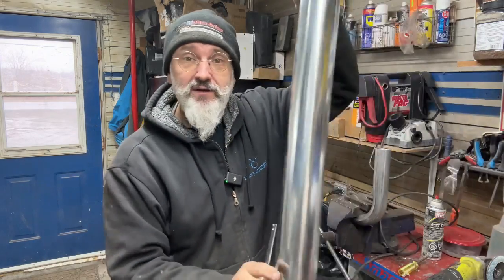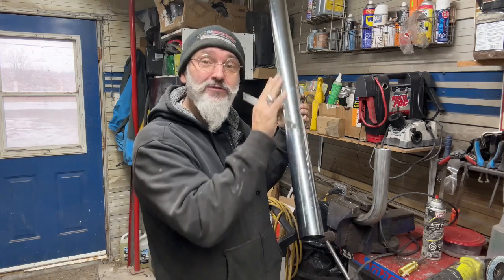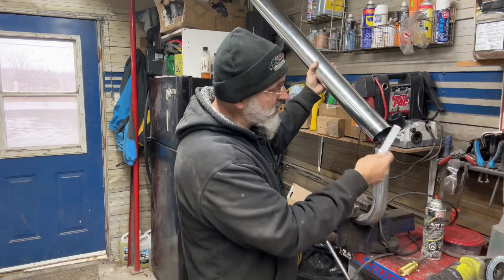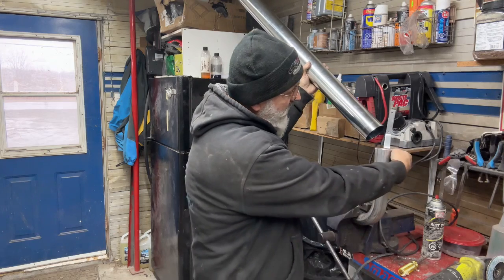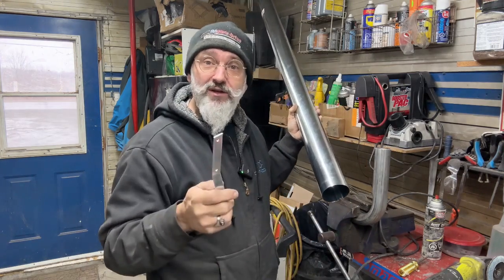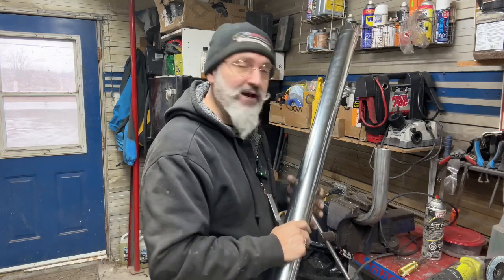We're going to be using 3-inch galvanized pipe. There's a little height limitation here, but we'll put it on an angle. This will be spaced 2 inches above — we're going to have a space of 2 inches. I've made the brackets; we're going to have 3. One will go there, one will go there, one will go there. These three brackets will keep that little airspace, or gap, and what that will do is draw in cold air, cooling it off so someone that touches it won't burn themselves, and it will dissipate the exhaust fumes, smell, and sound.